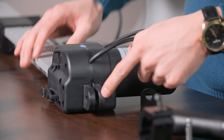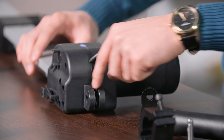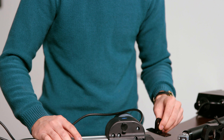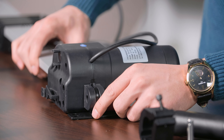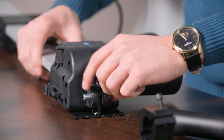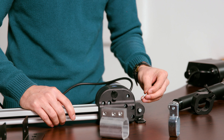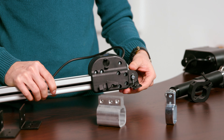As you can see on the motor end of the track actuator, this has space for a U-shape that fits over, or even a slot that allows for a T-shape mounting bracket. Just like the U-shape, place it into position, match up the holes, take your mounting pin, take your cotter pin, and place it through the mounting pin — and there you have it.